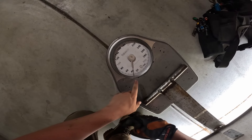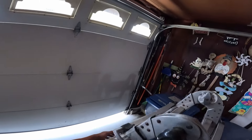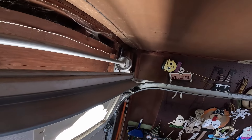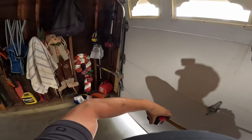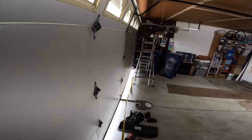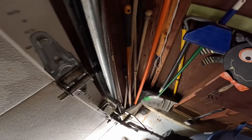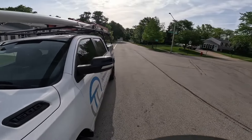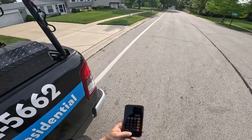As you can see, we're at 37. I forgot my phone outside, but it's no big deal — I've done this enough, I know what to look for. These are OMI8s. Let's check our radius — got a 12-inch radius here. And the door should be 16 feet wide. Yep, we're 16 feet wide. We will pick the door up, go outside, calculate the springs we need, and make them. Double crank on this side. So the calculation is a multiplier: 37 times 5, so that door is 185 pounds.